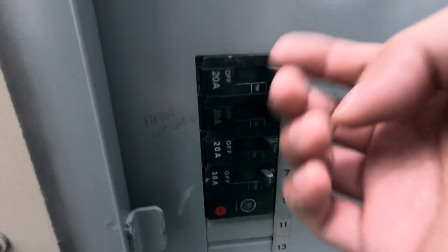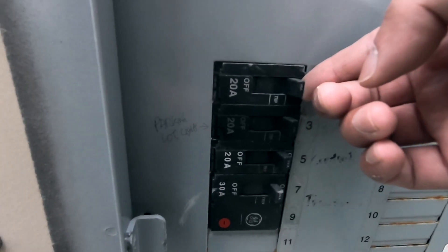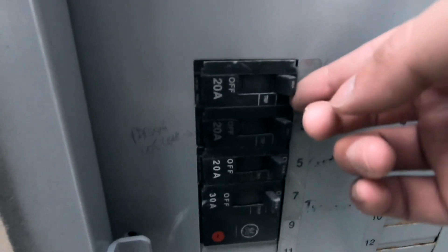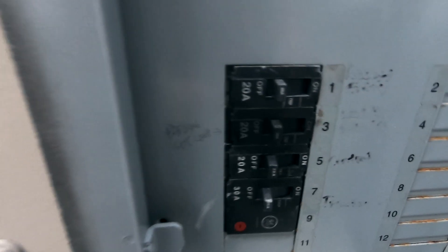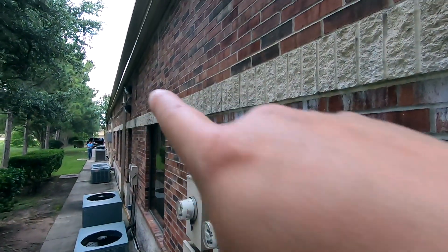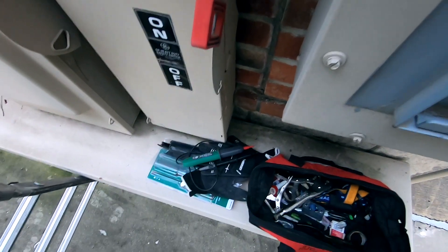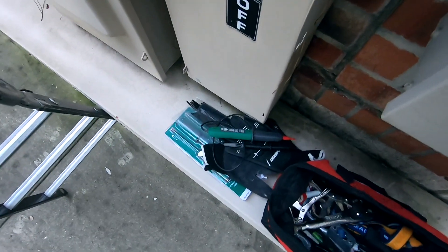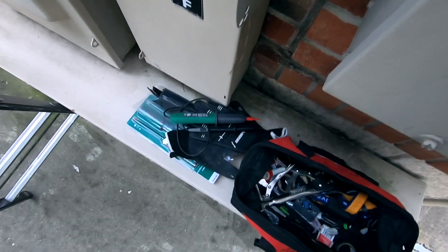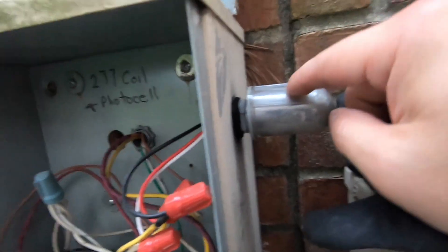The first thing we're going to do is turn off all the power. I'm not sure which breaker is the right one, so it's safe enough to just turn everything off since this is all exterior power for the property. You can confirm the light is off. To be extra cautious I'll be wearing gloves, using an electric sensor, and screwdrivers with insulated stems. We got the cover off.